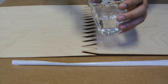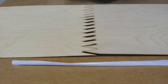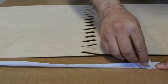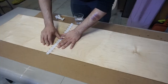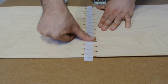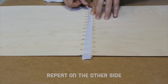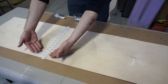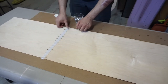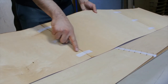To properly activate the adhesive of our veneer tape it must be amply moistened. Here we will be using our wet paper towel applied to the shiny side where the adhesive is, and then we firmly press it down. Repeat on the other side and allow to dry for two to three minutes. And here it is after it has dried — the veneer tape is running down the center of our zigzag. We have also similarly taped together our cross grain pieces.